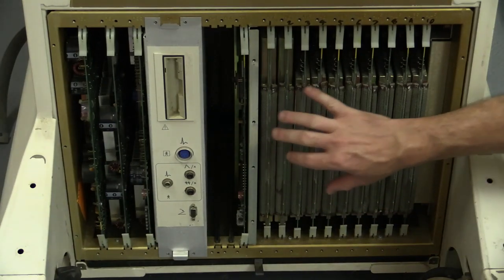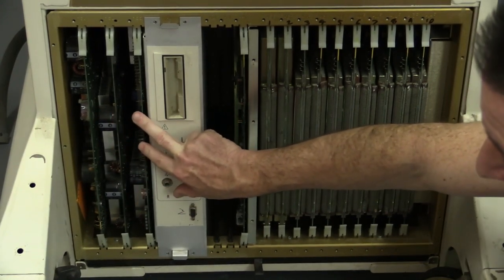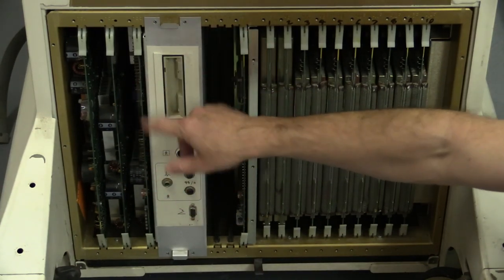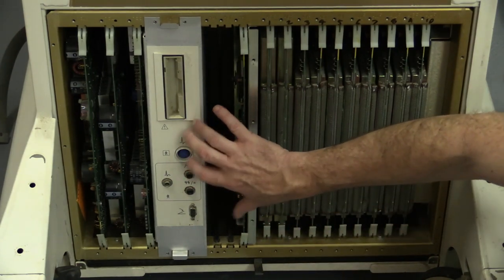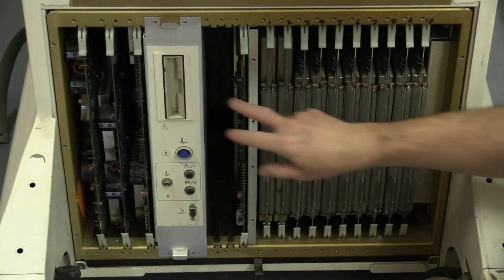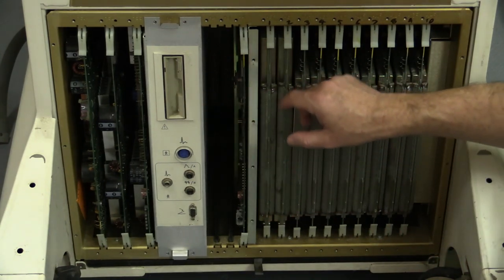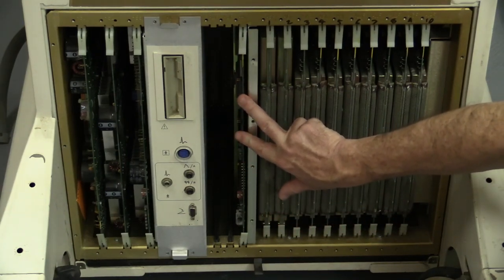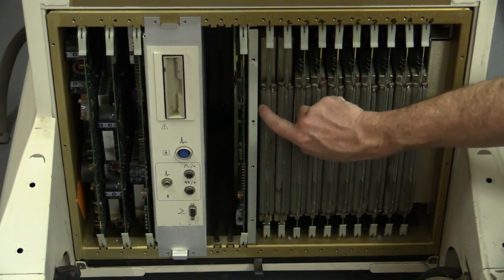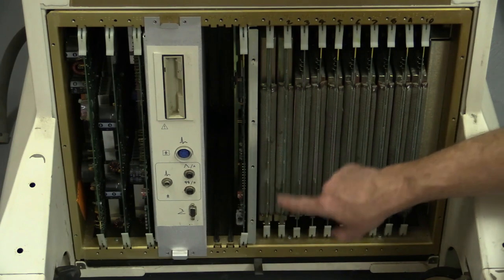Just to give you a very quick look at the boards inside this thing: we've got an analog power supply, a digital power supply — that's all plus five volts. We've got what they call a master power supply — plus/minus 12 volts, minus five, and a variable one. Then we've got a disc controller here — it's a magneto optical disc. I've actually got one taped on the back of the unit; it's got some software for it, so that might come in handy. We've got a front end controller board here, and all these boards are all heavily shielded. Look at this — all this RF braiding all down here. They've got PCI connectors on here.